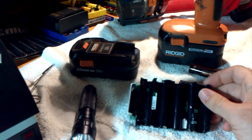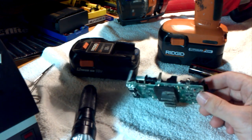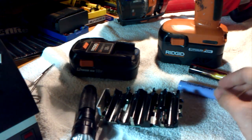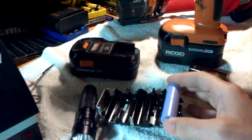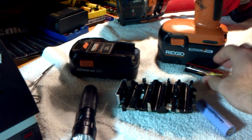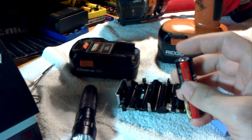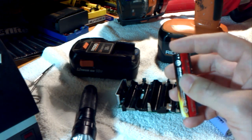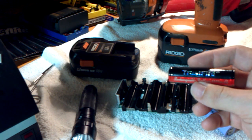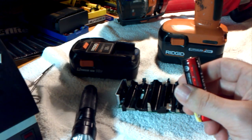Hopefully that explains in a little better detail what I went over originally. A lot of people have asked, if you aren't happy with the lithium ion setup that the manufacturers use, what do you recommend? Also people have asked: can I solder in new 18650 cells to replace the ones that have gone out? First of all, you can't — if your cells look like a standard battery with terminals on top and bottom, you can't solder onto that. You will destroy the battery by applying that much heat. I'm not saying that lightly — if you try to solder any kind of battery, no matter what chemistry it uses, you will ruin it. It might still work for a little while, but you did heavy damage to it. You have to buy pre-tabbed cells.